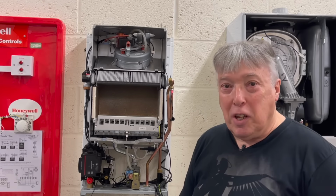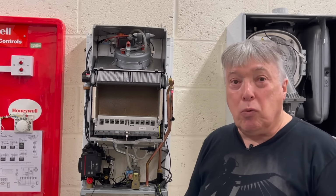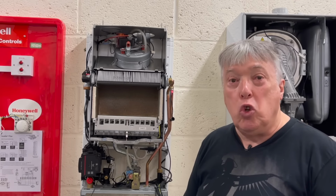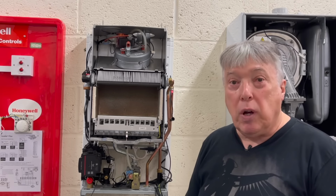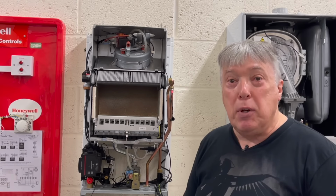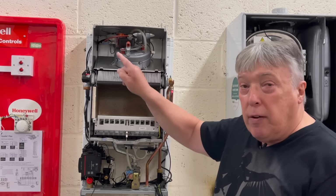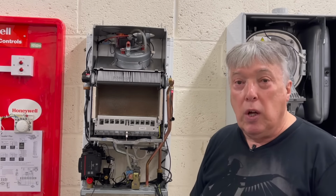Here's an excellent example of a single speed fan, and we're going to test it two ways. Firstly, we're going to spin the propeller, and then secondly, we're going to measure how many ohms there are between that neutral terminal and that live terminal. So first of all, let's just do the spin test.